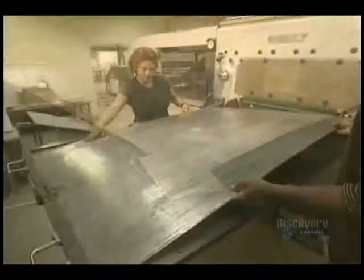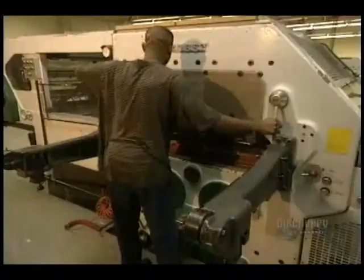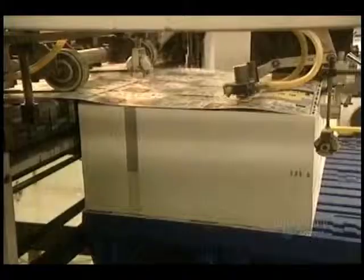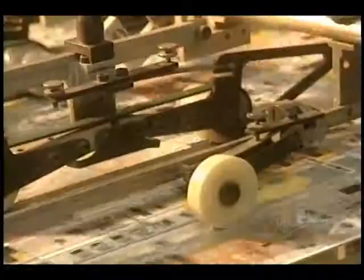Finally, they install this large metallic plate, which is the cutting base. It will be on this surface that the master die will strike. Once measurements are finished, the drawer of the die is slid into place. This press cuts the pattern seen on the puzzle. The sheets, or printed cardboards, go into the drawer one by one, where they are cut according to the master model.